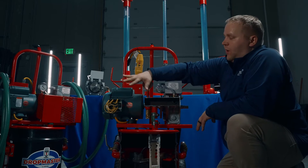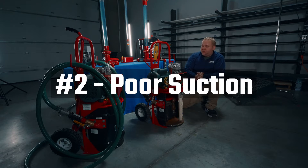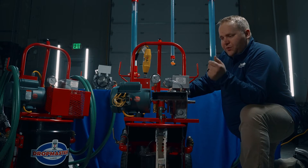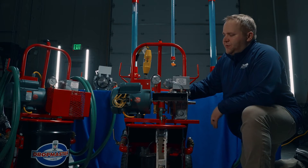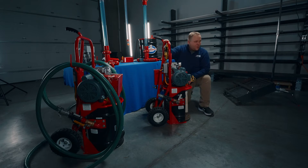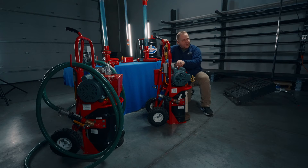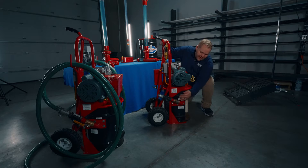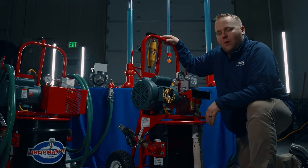So for the first issue — we turn it on and nothing happens — we check whether it's something electrical or whether the unit is trying but can't spin because the vacuum head is seized. Now let's talk about poor suction. You've gone to the system, it's turned on, but you're not getting your 10 inches of vacuum, or you pull the sprinkler and only a little bit of water came out, or it just doesn't feel like the same suction you're used to. First thing: close the ball valve on the unit to isolate it from the system. If your vacuum goes back up to 10 like it should, the issue is not with the DM-12 — there's a leak somewhere in your system. But if you're still getting poor vacuum with the valve closed, it must be something in the DM-12.